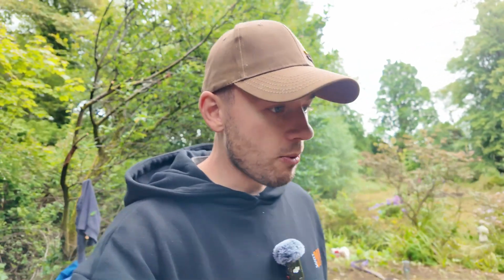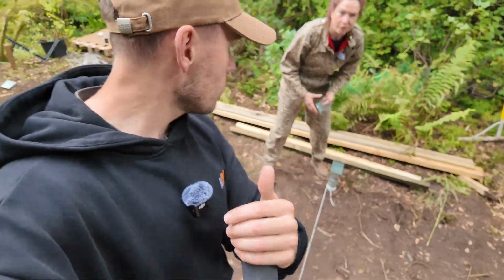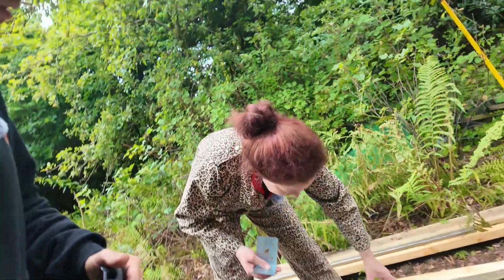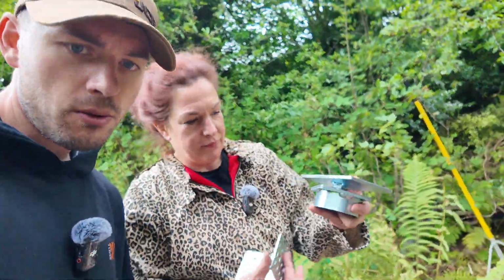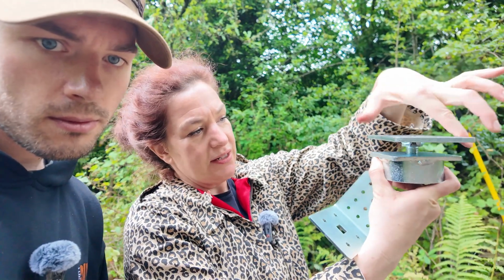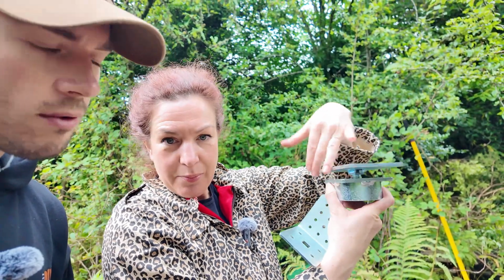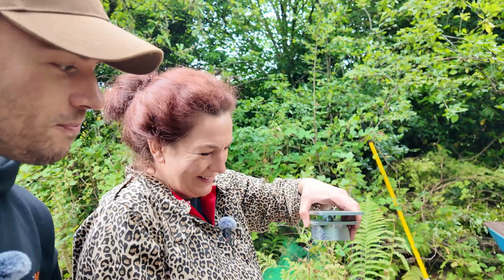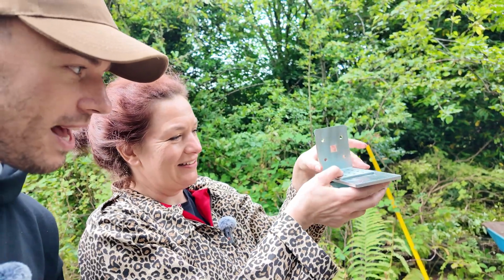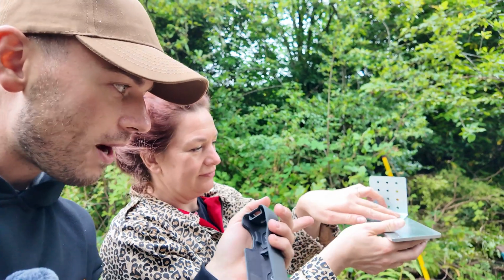And now we're at the stage where we're putting these little, what are they called, spacers? With the brackets. The brackets. So what Laura's holding here. They're quite handy. These are adjustable as well, so we can deal with any little height imperfections. Yeah. So if we are a couple of mil out, which we will be, we can just adjust it with that there. And then the L bracket sits on top, and then the timber sits against the L bracket.